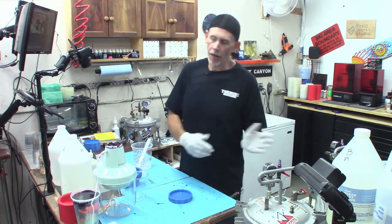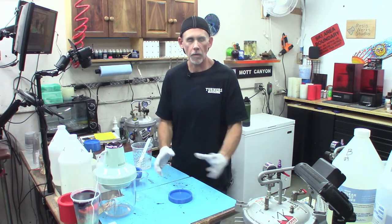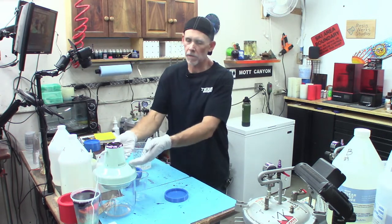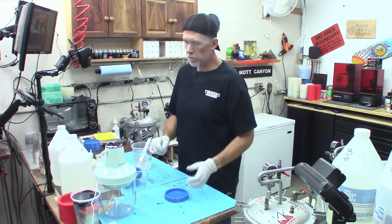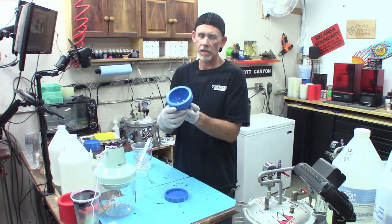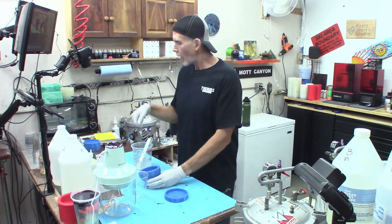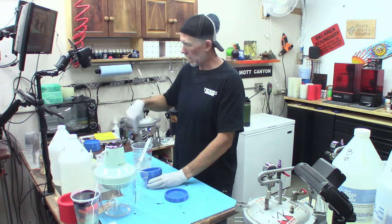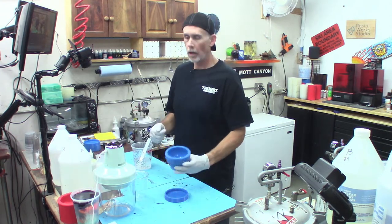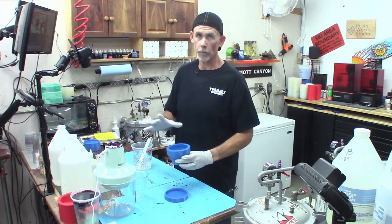So I would rather do that, but there are times where you've got to manipulate the thing, or where pressure is not the way to go. I don't think I would stick it in there. However, if all you're doing is pouring it in, this would be a good project to do that. I would probably degas after mixing the cup, then pour it in, and then put the mold into the vacuum chamber afterwards.